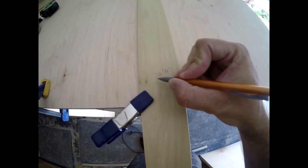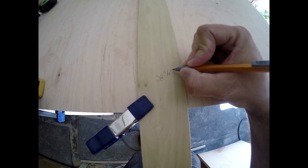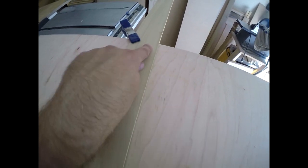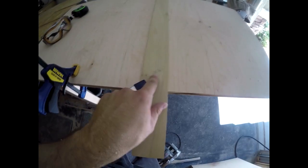To make this simple, because I have three pieces to cut all the same way, I took the tape measure and measured from this side - I got 28 and 7/8ths, and the minus symbol just means I'm just shy of the line. I go to the other side and match it exactly 28 and 7/8ths minus. With this clamp down, I ride the circular saw against this guide. With this measurement exact, I don't have to re-measure the next board - I can just put this at the 28 and 7/8ths marks and make them all exact. I'll go ahead and cut them all out right now.